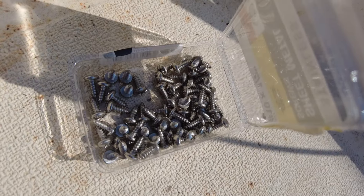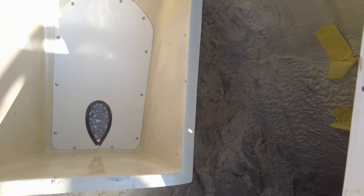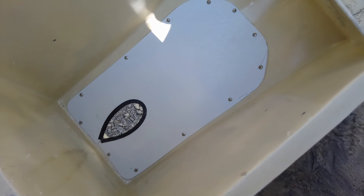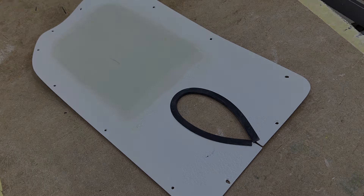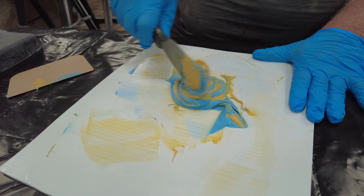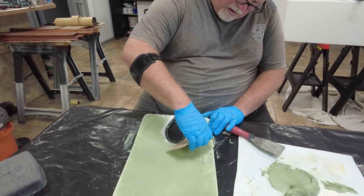That is the plug put in place. I decided to use some stainless number 10 half-inch screws, with sealant around the edges before screwing everything in place. The nice thing about this design is that it's very easy to install and also very easy to unscrew and remove when you take out the engine for winterizing. I especially like the FRP because I'm able to get it to conform to the shape of the hull. After the test fit, I laid some 7-ounce fiberglass cloth right where the FRP panel bends to the hull to help maintain the shape. With the fiberglass set up, it's time to do a little sanding and fairing using Total Boat Epoxy Fairing Compound, which gives good results and a nice smooth finish.